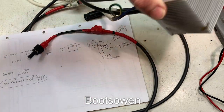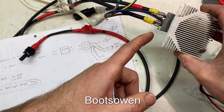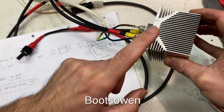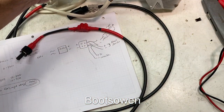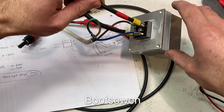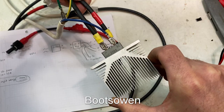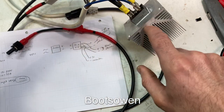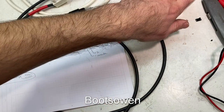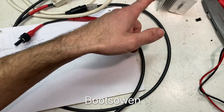Last bit of information — the rectifier is really only this little bit, and this is a CM3502 rectifier. It's mounted to a big heatsink from a CPU, a computer processor. There's a hole in the center of the rectifier, so I drilled a hole of an appropriate size to get a self-tapping screw to join in here — you can just about see what's going on. The screw goes straight through and I've put a load of thermal paste to thermally bond the rectifier to the heatsink. But after a bit of testing it's ice cold, so I'm not even sure I need that. It's quite a hefty rectifier.